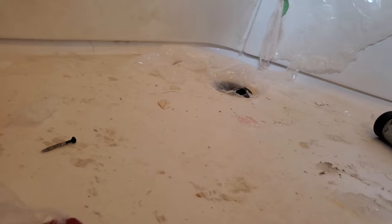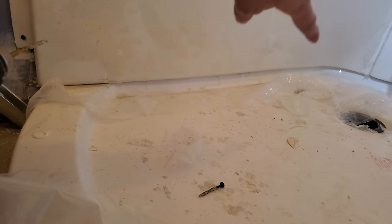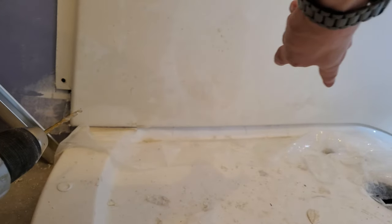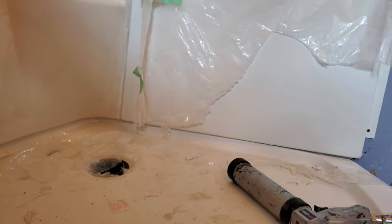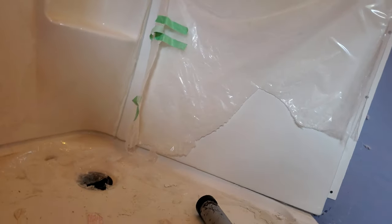I've already put up the walls, but as you can maybe tell by the shadow you can see here, the wall is where it's supposed to be, but as you go towards the corner, it basically pulls out from the studs — the base, whatever. So my next task is to unscrew everything and pull the walls down, clean up all of the silicone down here, then reapply it and push the thing in properly.